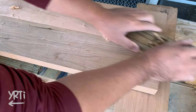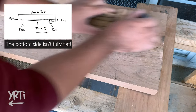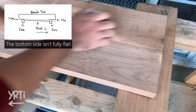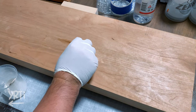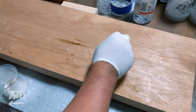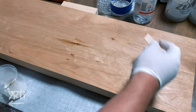Next day, I roughly cleaned the surface. For the backside, because I wanted to keep this board as thick as possible, I only flattened both ends where I'll put the feet. I also filled the imperfections with epoxy at this time. Waiting for the glue to dry and the epoxy to dry on two consecutive days is kind of a dilemma.